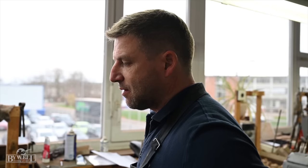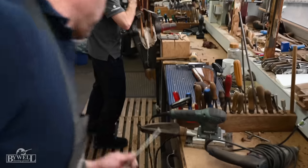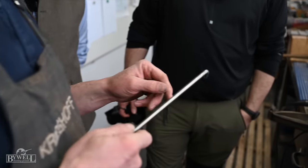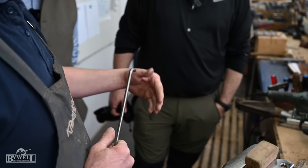And you mentioned yesterday the oiling process. You start without the checkering, you oil it, and then you do the checkering because it gives the wood more strength. The thing is, it is more or less like sawing in the checkering. It's just the tool we are using, which has these teeth. It's like a saw, but it's not working normally. A steel saw goes to push. It's just cutting at the push movement, and that's it. It's a tool which is working forward and backward.